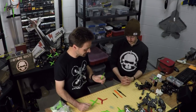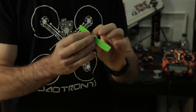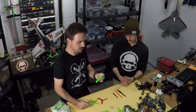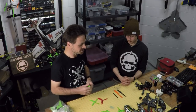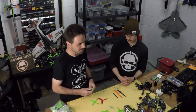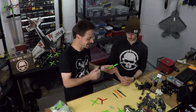One other topic worth talking about is the pitch of the prop. For example, it's got a pitch of 4.5 inches, and what that basically means is every single time this does one revolution in a perfect world, it's going to go forward 4.5 inches. As you increase the pitch, it's going to go faster through the air for the same rotation. One would think let's just make an insanely steep pitch and get a really fast prop. The problem with that is it increases the surface area, increases the drag, decreases the efficiency, and increases the amp draw. So you get a lot of negatives as well as positives — you don't get all the positives without getting some of the negatives.